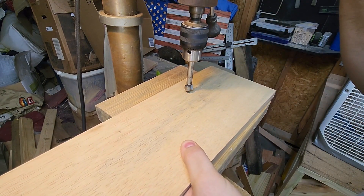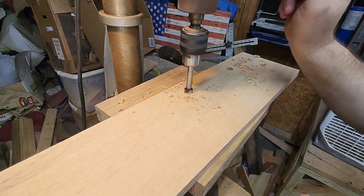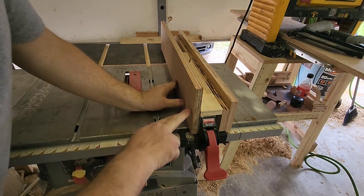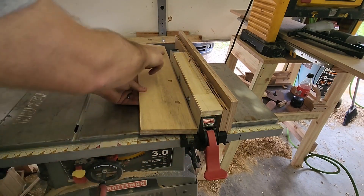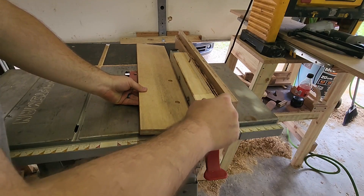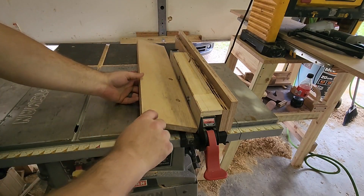I've loaded up a half-inch Forstner bit here — this is just going to recess into the inside panel to hide the bolt head. I'm going to get this thing lined up. Now I'll run a line of glue down the inside of the center spacer here, brad nail that across, and for additional support I'm going to cut a strip to fit it down the length and glue and brad nail that in.